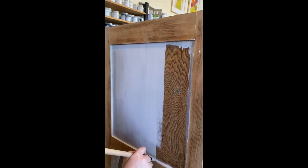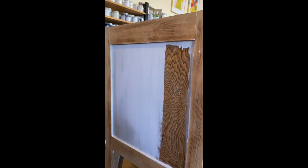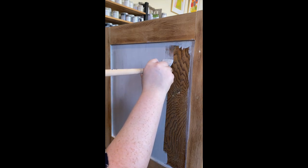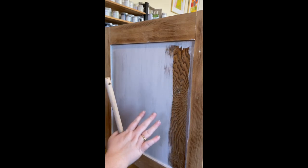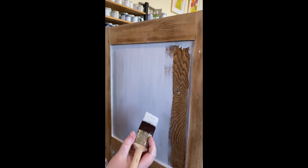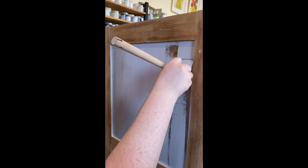And then I have given it a really good clean with some hot soapy water using Pureco's Lemon Myrtle Cleaner. Prep is super easy for this one — I'm painting over raw timber, I don't have an issue with adhesion, and I'm not concerned at all with bleed through, so I'm fine to use silk finish straight on the board.